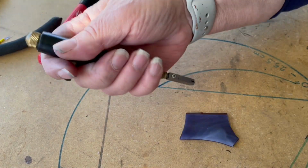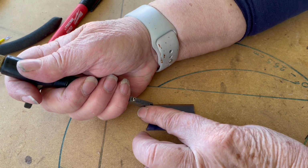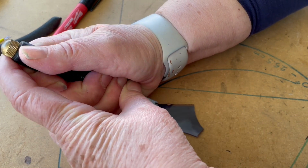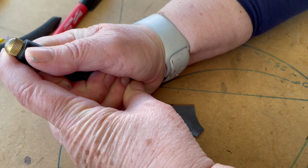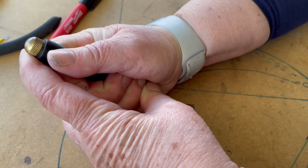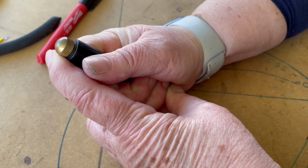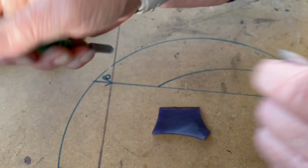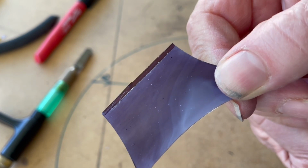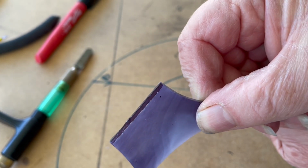Let's have a look at it in reality. It's all well and good to say it, but let's do it. Keeping fingers crossed. So my eyes are focused on the edge of the head and the edge of the glass. And I'm going slowly because I don't need to win a race. And I just want to cut the grout line off. So I've scored it. See, a bit of patience and you can be as accurate as all get out.